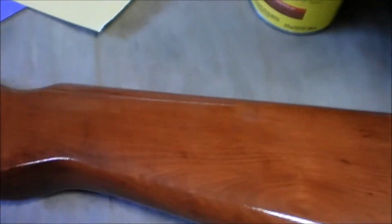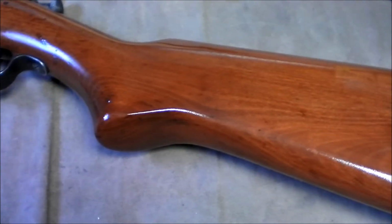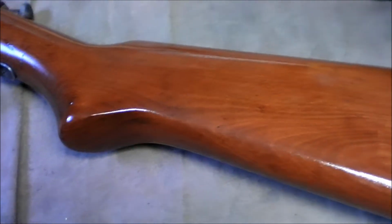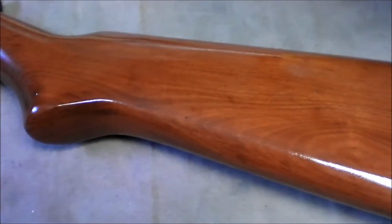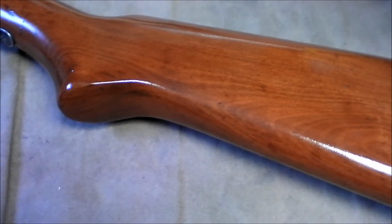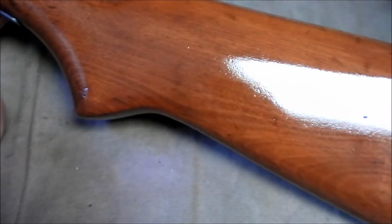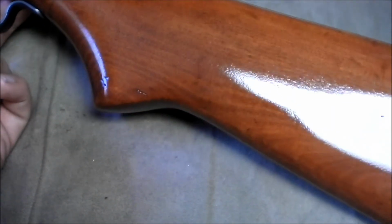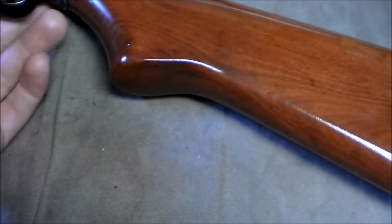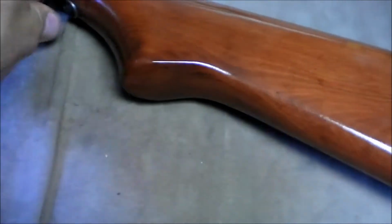But I did one stain, really let it dry, like overnight in front of a heater. I mean really let it dry, cure up all the way, and then I stained it again to get it a little darker, and really let it cure again. That time I let it cure for like 2 days. One day in front of the heater, the other one not.